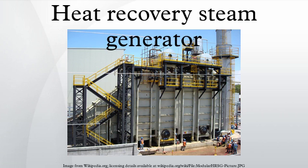This usually means that the evaporator section of the HRSG will have to be split and the SCR placed in between the two sections. Some low temperature NOx catalysts have recently come to market that allow for the SCR to be placed between the evaporator and economizer sections.